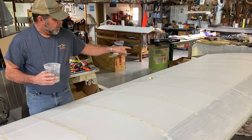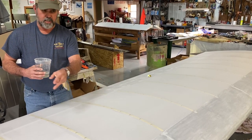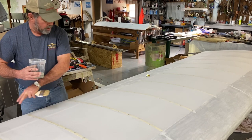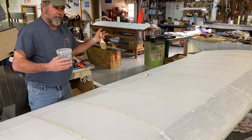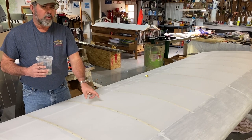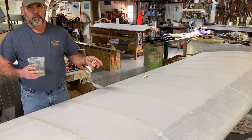There's also a total of 30 ribs — both sides — 15 or 16 ribs of two-inch tape that I'm not putting on, plus 160 inches each way of two-inch tape. When you figure all those square inches up — I've got it written down — it's over half a pound of tape that you were going to put on anyway. So when it all comes down, it's less than two pounds added.